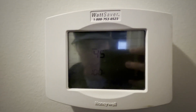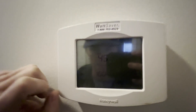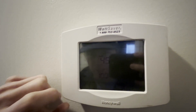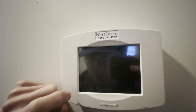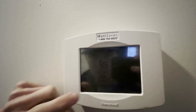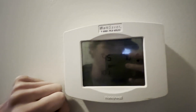It's going to be a little hard to read here, but right now our fan is on auto, system is off, and it's reading 45 degrees in the house. We're going to go ahead and update our system. Now it's on heat. Fan's on auto, reading 45, set point is 70. Now down to the furnace.